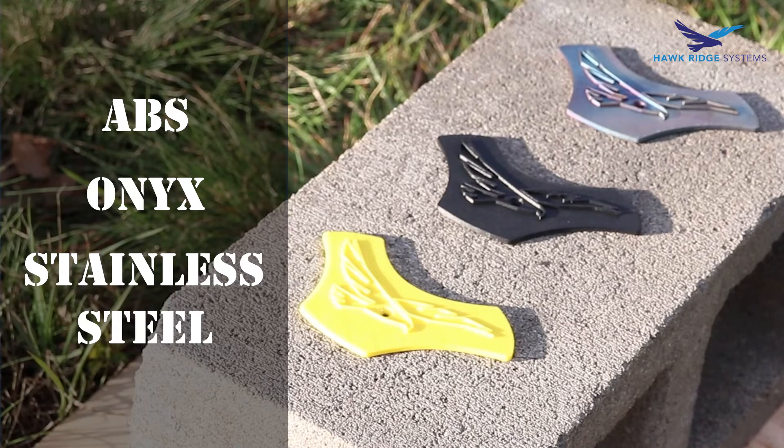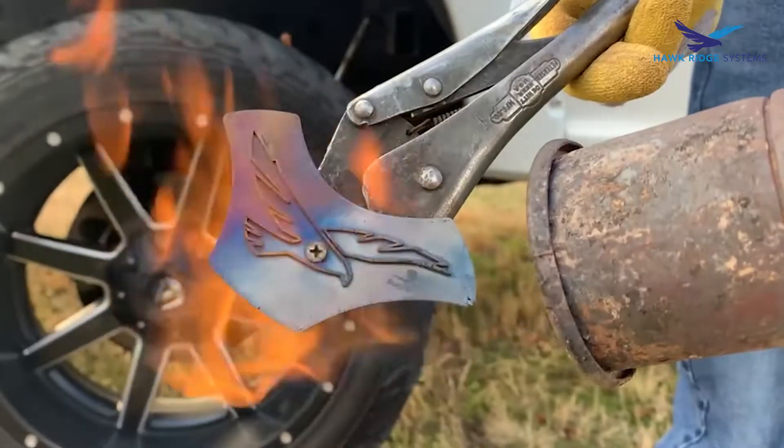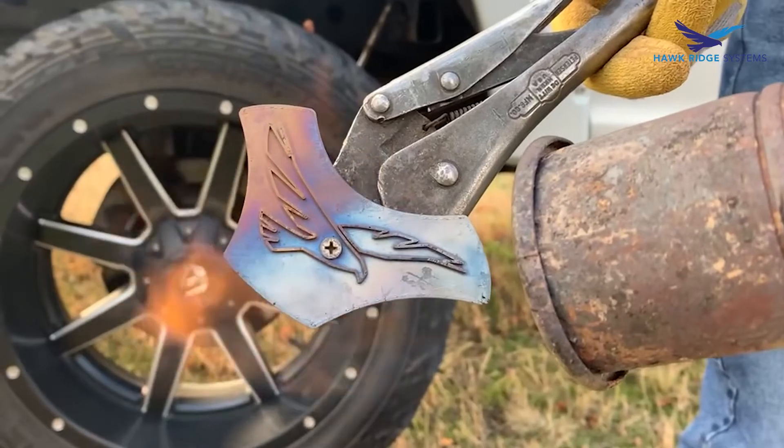When we started thinking about it, a lot of the Markforged parts we can make pretty strong with fiber reinforcement — we may not have to go to that extent here, which in this case we didn't. We ended up just running with the Onyx material for the composite printed parts. We tried out a few different materials in typical fashion. Most leather stamping tools don't need to get hot, but we thought we could take an additional step and make it more fun by dual-purposing this thing as a leather brand — that was the main reason we went with the stainless steel stamp. The one that's still intact worked really, really well.